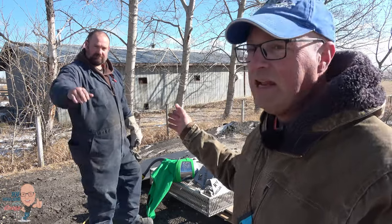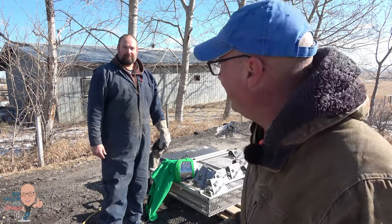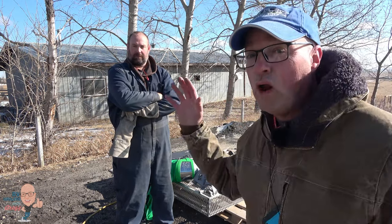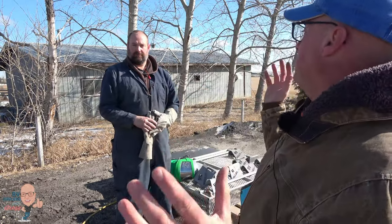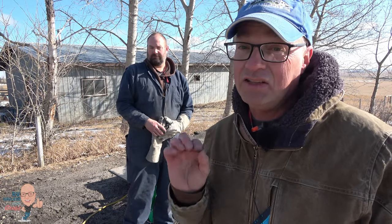We've got Rob from NA Tech. Rob has been taking care of my sandblasting needs for many, many years — I'm never going to let him retire. Rob is in his Sunday best; he said if he knew I was going to videotape him, he would have worn something a little bit snazzier. What Rob has been doing is sandblasting all kinds of commercial and residential projects for many years. What's awesome is we're able to go right from sandblasting into a controlled environment — no humidity, beautiful sunny weather today, low humidity, not raining — so we can make sure the steel stays as white as possible and doesn't get any rust contamination.